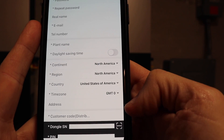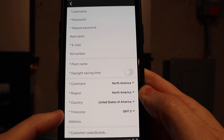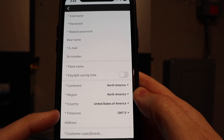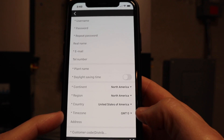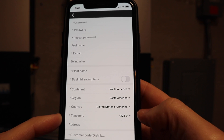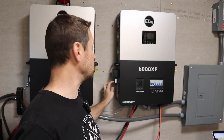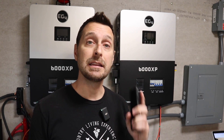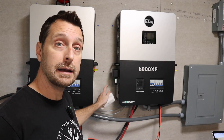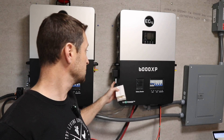The software uses Greenwich Mean Time for the time zone. You'll need to find the GMT offset for your area — here in the central United States it's GMT minus six hours. There are maps and charts online to find the correct number for your location. When you initially plug in the Wi-Fi dongle you should get one green light on the bottom, indicating it's connected and has power. From there, on your mobile or computer go to Wi-Fi settings and look for the address serial number of your dongle, which is written on the side of the dongle and on the box. Don't lose the box in case the sticker gets damaged.